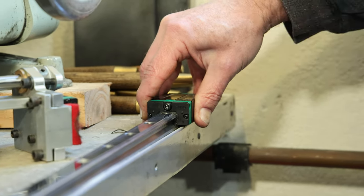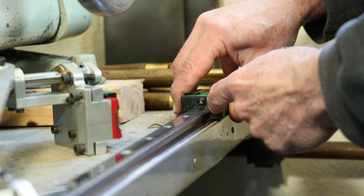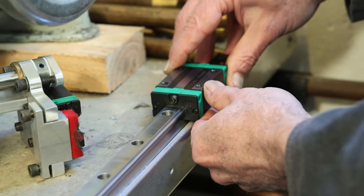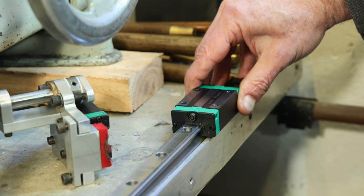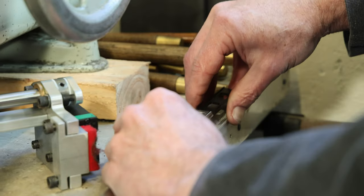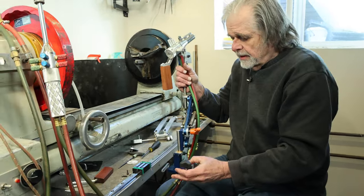The first thing you do - and everything about this has to be done slow and careful - is to first maneuver the leading edge of the rail into the rubber wiper, and then very carefully finesse the bearing into place. If it feels like it's binding or crooked, stop and think about it, realign, and do whatever is necessary. It should slide on very nicely and neatly once the bearing has been put on.